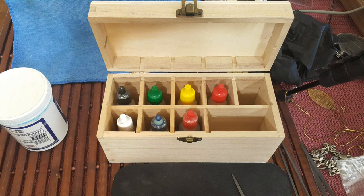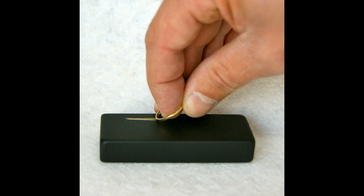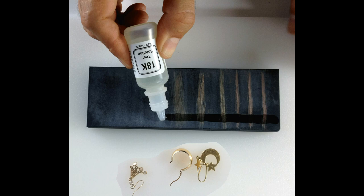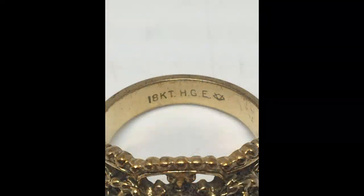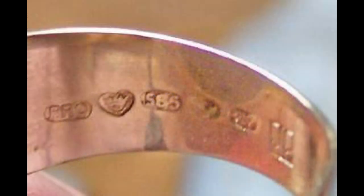One of the best testing techniques in my opinion is the touchstone testing method. This method is one of the oldest methods to officially test precious metals, dating back to antiquity — it was first recorded by the Indus Valley civilization circa 2600 to 1900 BC. It involves rubbing the precious metal against a touchstone and then administering an acid to reveal its purity. Most jewelry comes with what is called a hallmark which will identify what the piece is made from, and it is important to become familiar with the different hallmarks and what they represent.